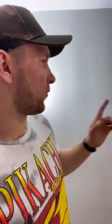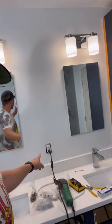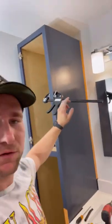If you don't have your wire back there — because most of you guys don't, we do because we knew we were going to put something there — what you would do is cut out that hole, go in your attic, drill a hole in that same cavity, then feed a wire down into there and out of this box. You would then run someone up into the attic to catch that wire, bring it down, connect it here, bring it over to the other side, and then connect it there.